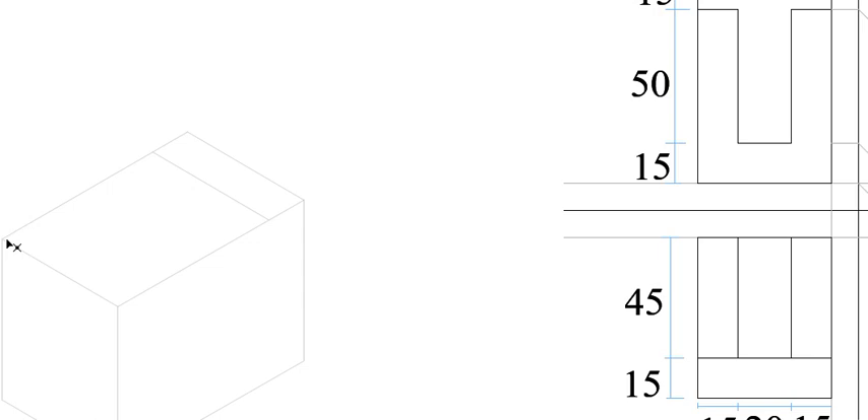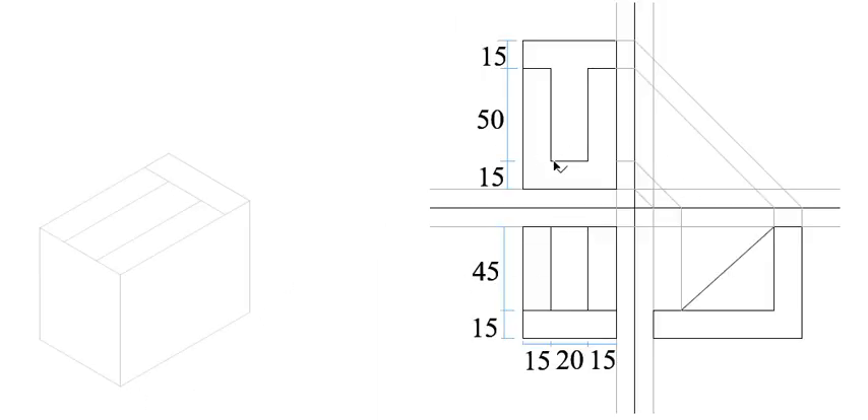I want this line here - to get the dimension from this side, from this edge here, I am going to measure 15 millimeters this side and make a mark, then make another on this side and draw a line. We shall draw that like this. We shall also have this one at 15 millimeters. Let us trim this part like that.